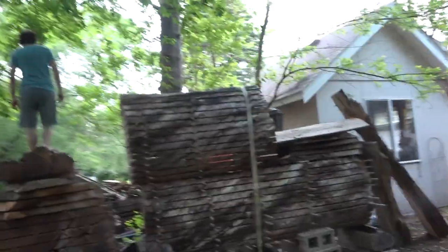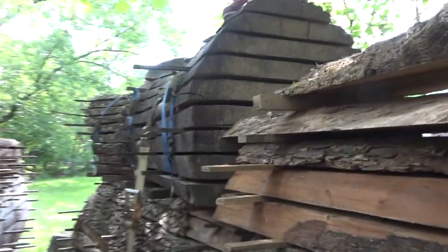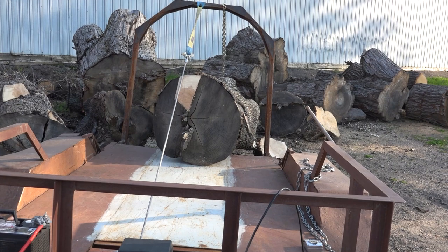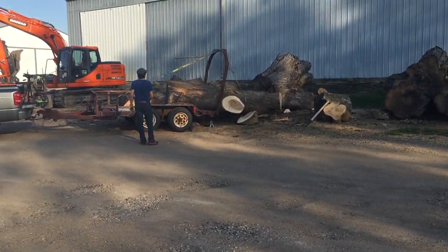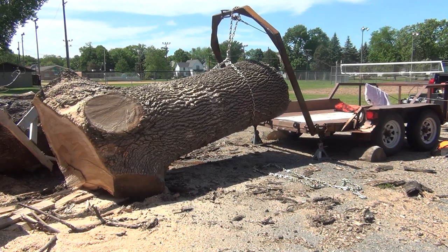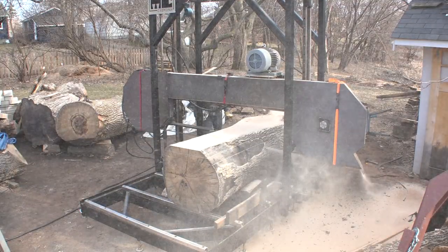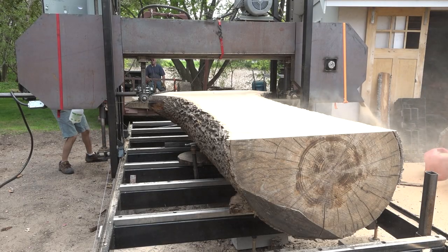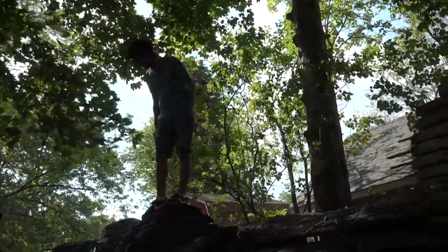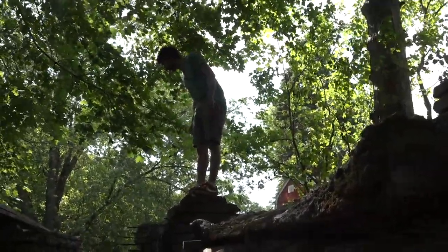Behind there I have two ash logs — some of the first big logs I picked up with my trailer. I have a video about going and picking up and offloading the one I'm standing on. The bigger one at the bottom was one of the last large logs I pulled out of the big dump pile a few years ago, and both were sitting in the driveway as I was building the bandsaw mill. The smaller one was the second log I put on the mill, and the bigger one was number four. They've been cut for just over two years and are at outdoor equilibrium now, so they can go in for final drying at any time.